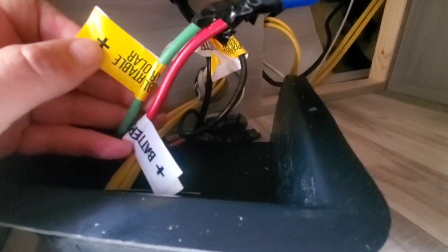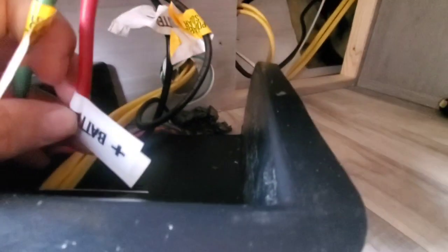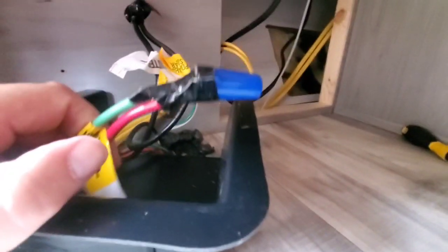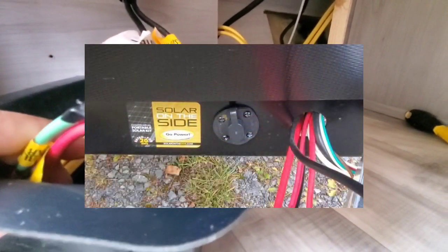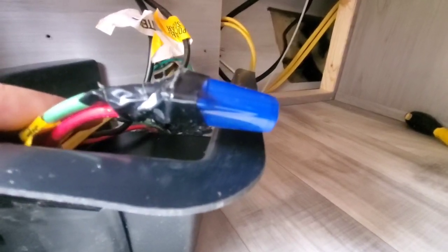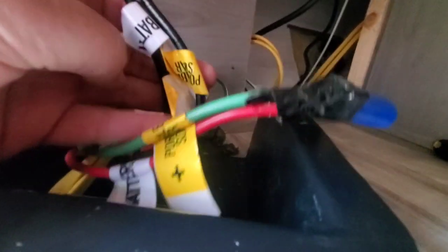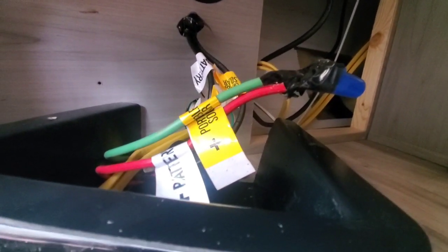Inside, this is labeled 'portable solar' — positive and battery positive. That jack on the front with the Rubicons, there's a portable solar jack on the front of the frame near the battery box, and that's hooked together — the portable and the roof both hooked together, that's my assumption right now. There are also negatives labeled portable solar and battery both being negative. So what I have to do is attach the red, the green, and the two blacks to the four posts on the solar charge controller.